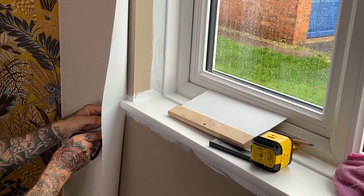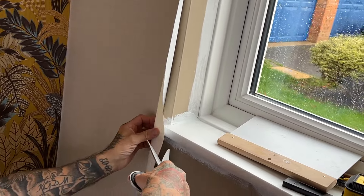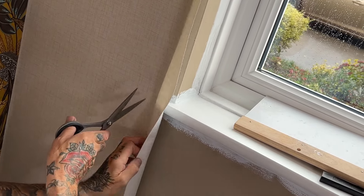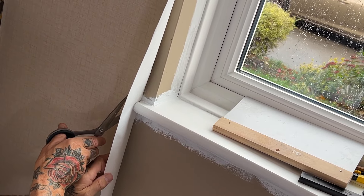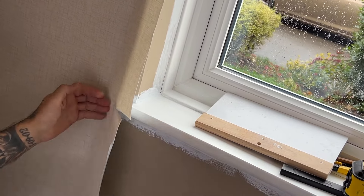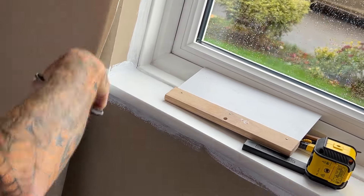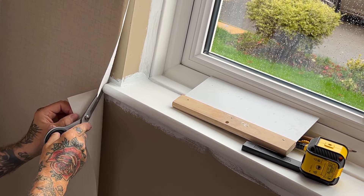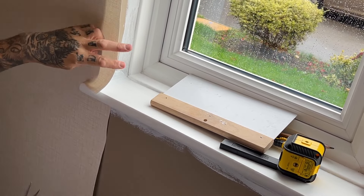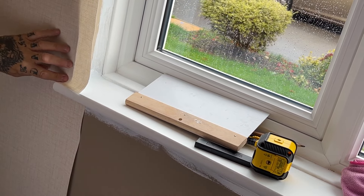Find where the window sill is on the wall — I've made a mark with the scissors. I've made a little indentation with the tip of my scissors where the sill meets the wall. I just pull that away and make a vertical cut up to that mark, then make two more diagonal cuts to each corner of the sill. I've made three cuts around the sill and then just ease it around. Sometimes you can make more than three cuts — as many as you like — just to ease it around the curve.